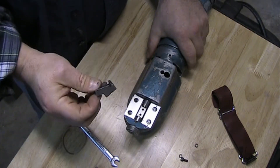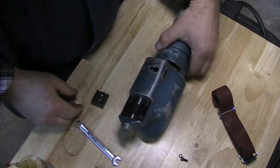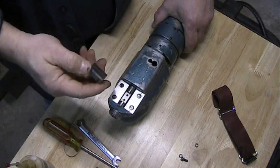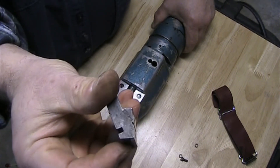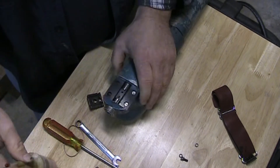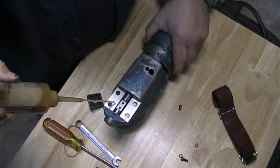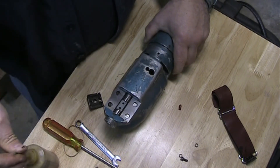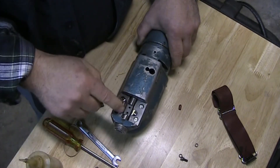The next thing we're going to do is put the shoe on, and that's going to require a little bit of oil and a screwdriver. On the base of this shoe, as you can see, there's a groove for oil. You basically just tip it on its side and run a drop of oil into that, and that should lubricate the ways as this thing slides back and forth. I'll take a zoom spout and apply some oil — probably way more than I need, but I can always rub it off.